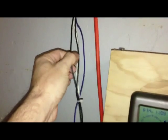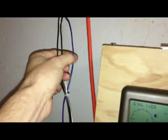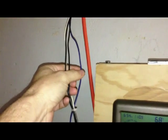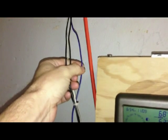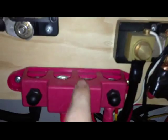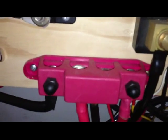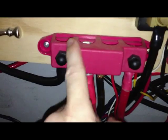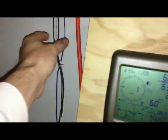The Trimetric has four leads. You've got these two blacks. You've got this blue — this blue just goes right to the positive terminal of your battery bank. In my case, it's right here; you can see it right down here. It connects onto my positive bus bar, and this is connected directly to the battery. That's correct — that measures voltage.